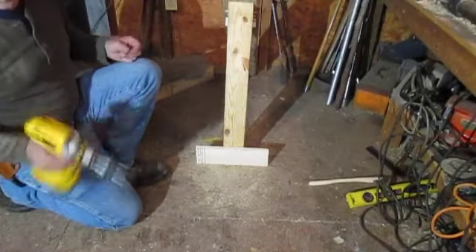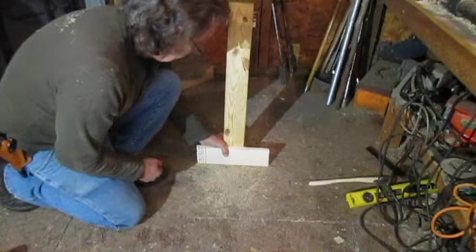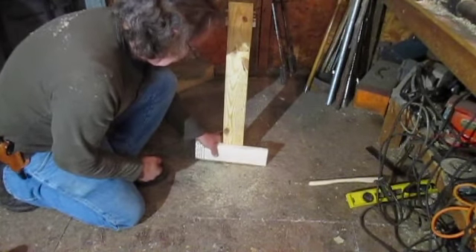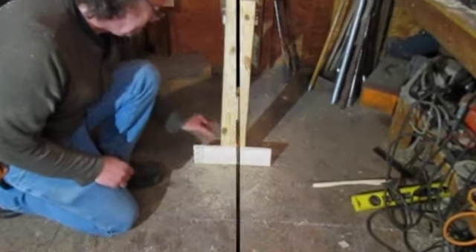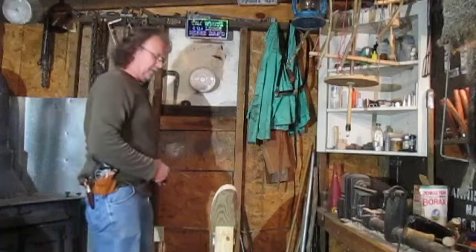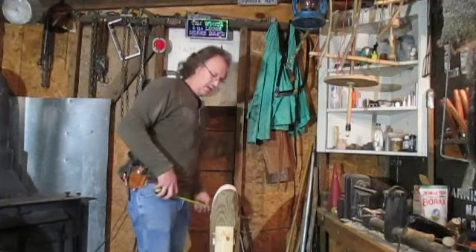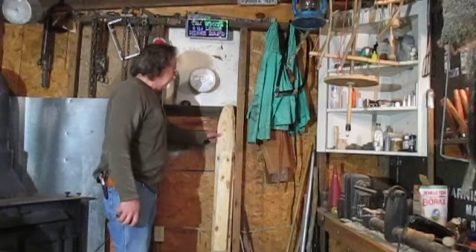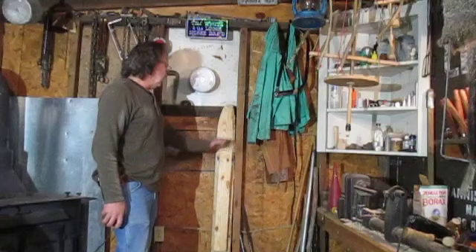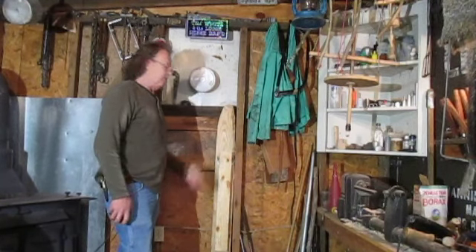I've decided to add a T to the bottom so there won't be any kick at the base and to keep the tilt off of it. I'm going to screw that board right on there. As for measurements: mine is 57 inches long and five and a half inches wide, and it sets right up there out of the way. I'm also going to put a little button on the wall so it doesn't accidentally get knocked down and hurt somebody. But there it is — a fold-away fleshing beam.